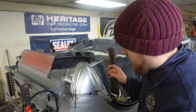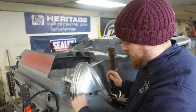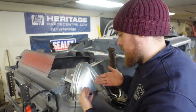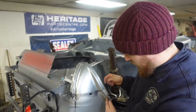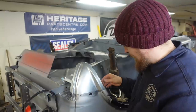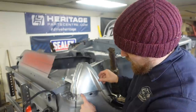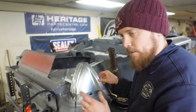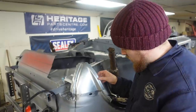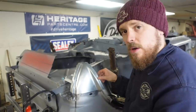So that's that piece all cut and sorted. I did it in exactly the same way as the other piece — overlaid the oversized panel, screwed it in to pull the panels together, put a bit of a wedge in here to pull it out where it was pulling back, and then sent the grinder through the whole lot. I did go back and cut another millimetre out of it because it was a little bit tight in places, but it's now sitting where it wants to sit. So we can put our spacer in to give us our gap for welding, and we can start welding this up.